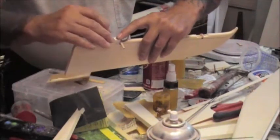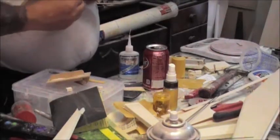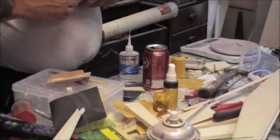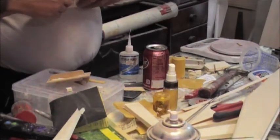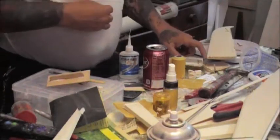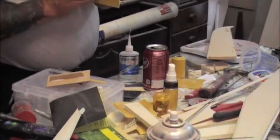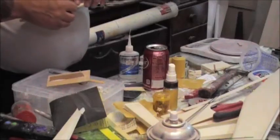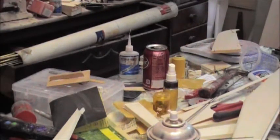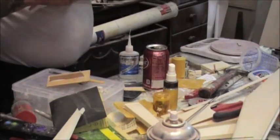Okay, I've cut one of the pieces until the slot or the groove looks about square. Want to make sure you force the wire down into the wood. We want a good wood-to-wood bond so that that hinge stays in there. And I know that it seems like a lot of work for hinges. And it is. But the hinges are so free. I'm going to have to hit that again with this belt sander. The hinges are so free that I'm not ever going to do another one any different.